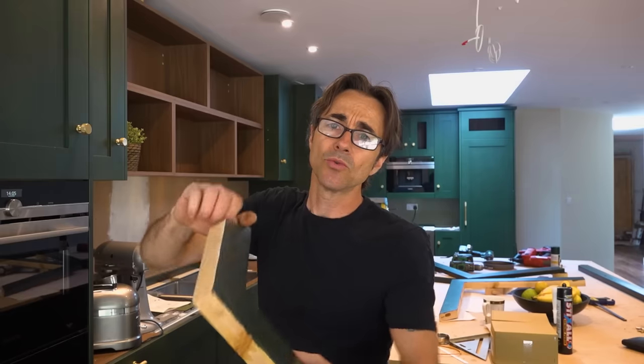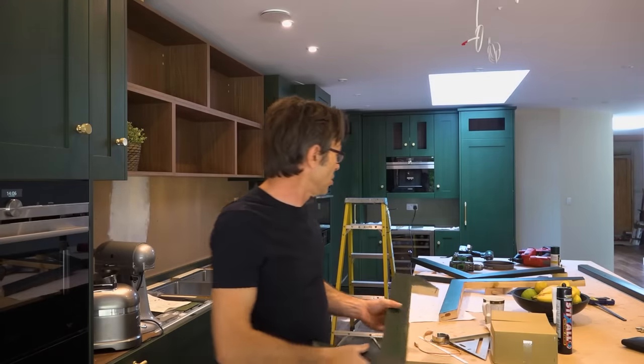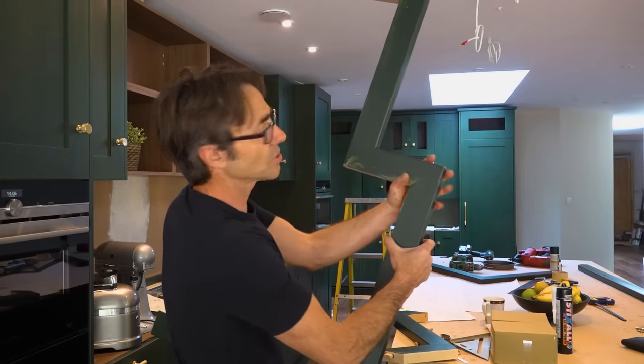What I did first is I went round, machined all the timber up, planed it all, rounded it all over where necessary. Then I took each section, rough cut everything in, held them in situ, marked them with a margin stick, then took them to the saw, mitered them all, and then I dominoed all the corners. These ones are already joined together - glued and fixed. This one's ready to do in situ. The far end behind me I made the whole lot in one slide over, but this side's just too big to do that working on my own. So I've got the end here and the end there, and I'm going to get those together fully, then join them to the middle section - the long section that goes through.